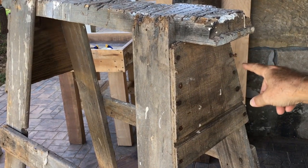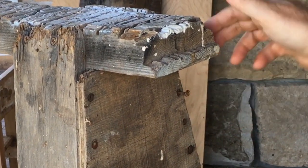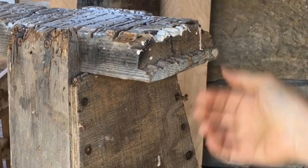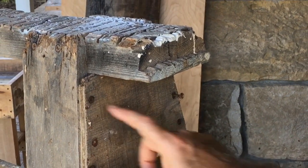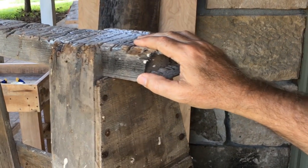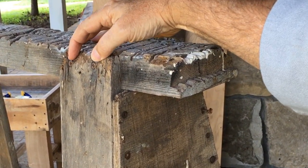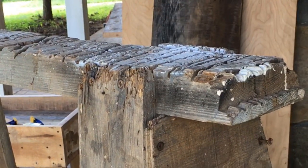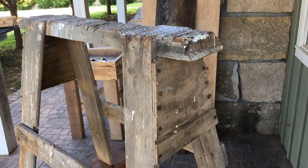But one thing I wanted you to really notice, and I hope the camera can see this, is that this nail is sticking out about an inch, which is the result, again, of nails not holding under stress. So back and forth, and the nails work their way out of the wood. Whereas screws that are much, much older than this particular nail are still relatively close in there, although she sure is a rocking thing. And then up here, I only used 2 screws on the end, and I came in with 3 on my latest. And of course, I applied all the glue, which I think will create an even longer lasting and more durable sawhorse.